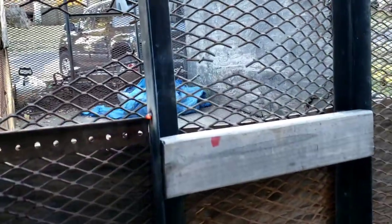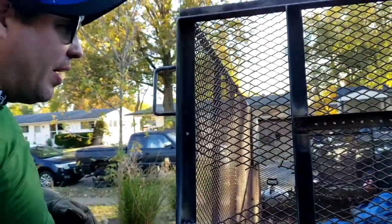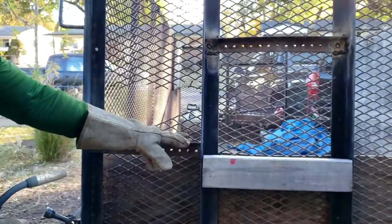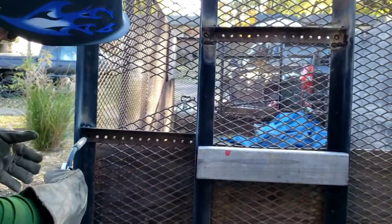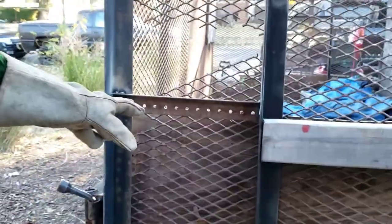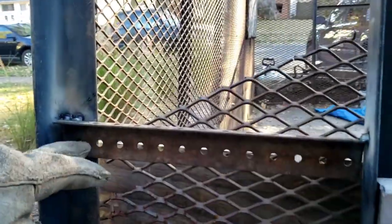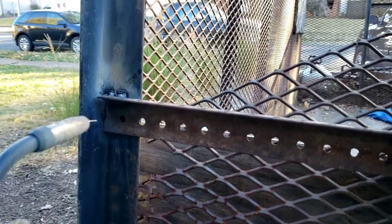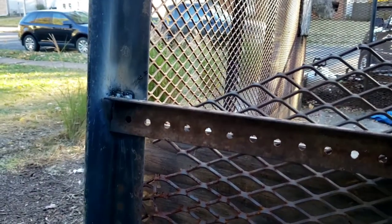All right. There we go. A little better weld. I'm a little thick. For some reason, I'm tired. I'm having trouble holding my arms steady. I'm like wobbly. The other day, fine. Now, not. So, you know, you get two little spots, hit it up, and then we're gonna zoot zoot. I like this stuff that I've had. It's just because I had it already, but these holes in the middle make it real nice that I can hit in the middle of the hole. And I just go straight in and fill it. And it's another spot that holds it, all right?